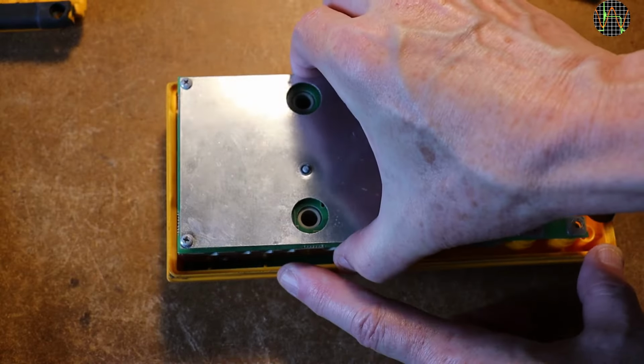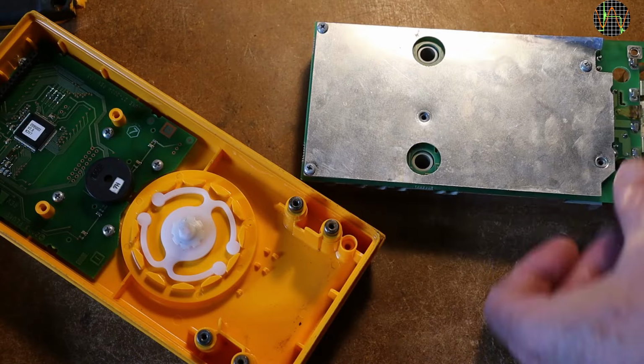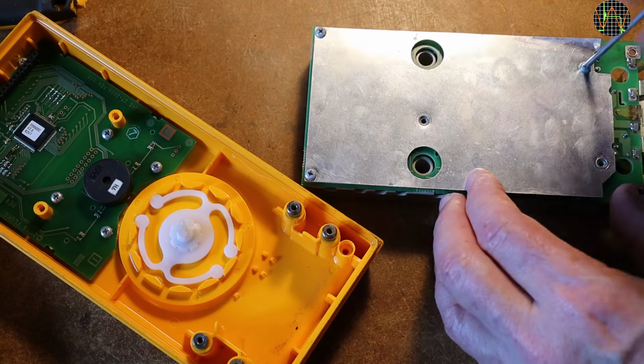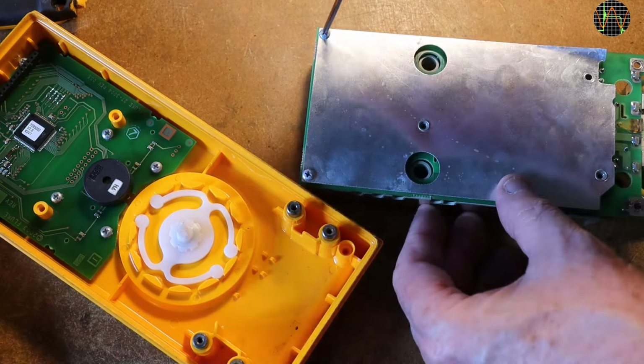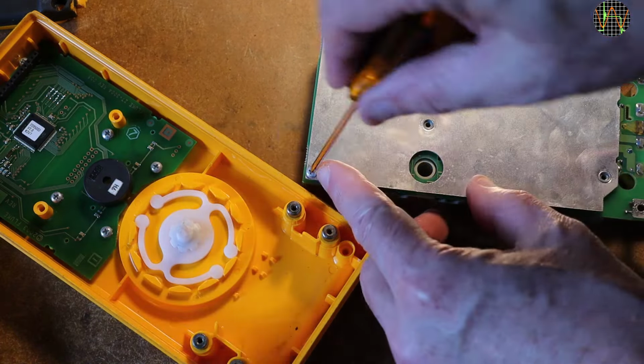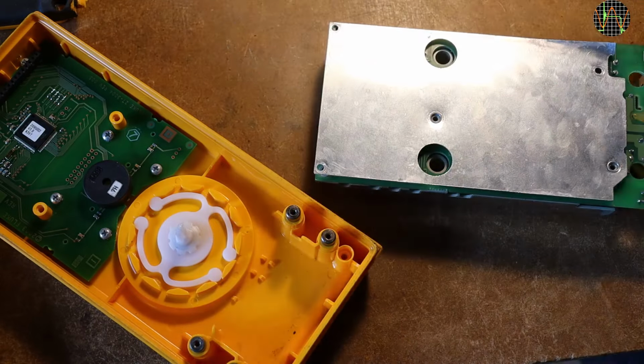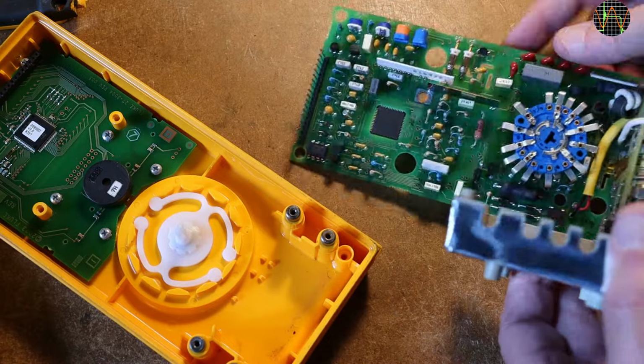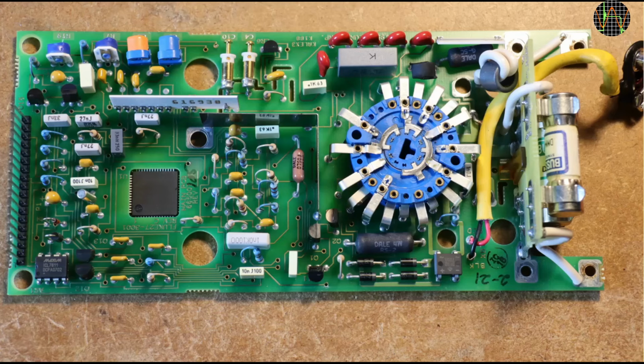Let's dive right in. I'm shortening the whole opening sequence as it's exactly like for the Fluke 25 I fixed a while ago. At least there are no bent pins this time around. Because the display works, the problem is unlikely to be on the display board, so let's get the shields off the analog part. The analog PCB does not look too bad. Considering the cracks we saw earlier, indicating maybe a drop from considerable height, I was kind of expecting loose components, but nothing of that sort.